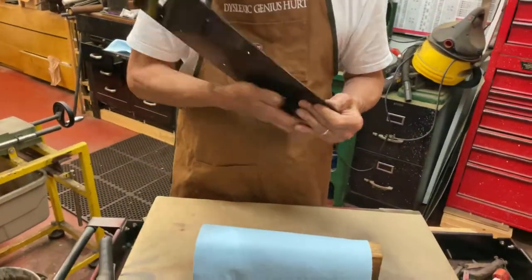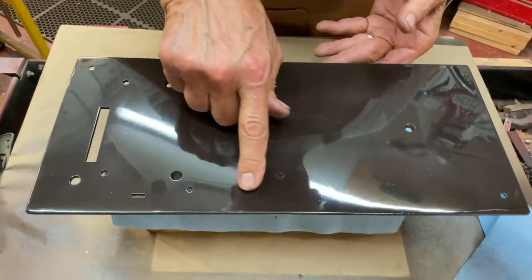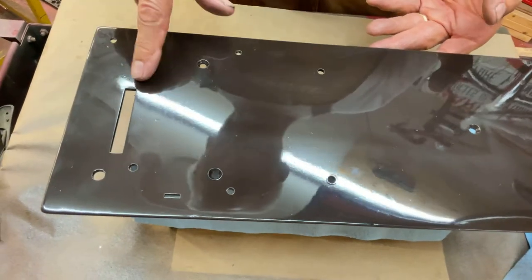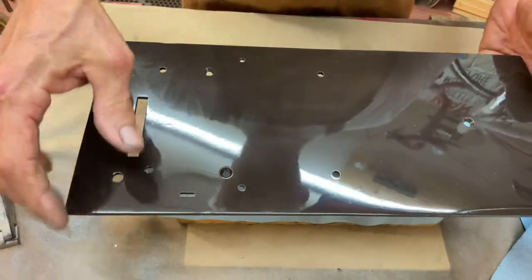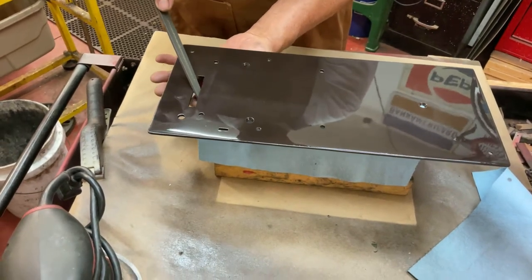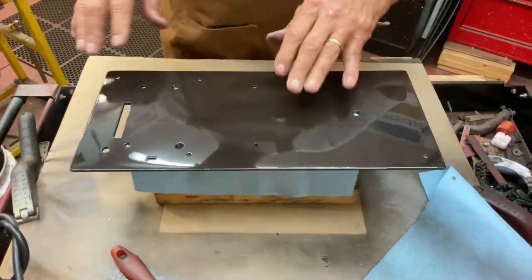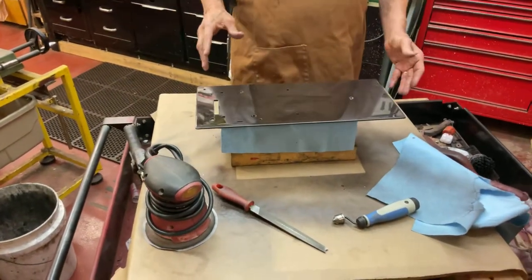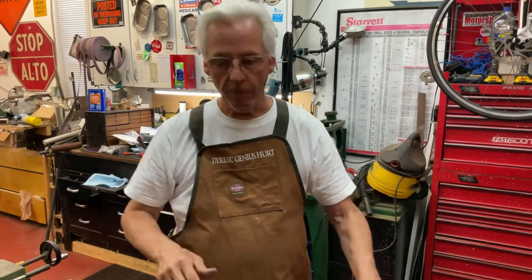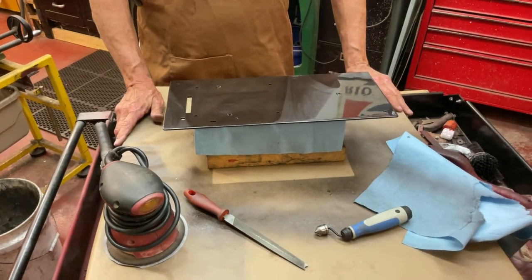So when you get to the top of it, now you're seeing the reflection from the paint. I've deburred all this, so these are all nice and smooth now. There are huge burrs here — I still have to get a little bit more. I got the burrs up here with a file and will gently come in and file that down — maybe with a jeweler's file or a really small file. Before I sprayed, I took my orbital sander with 320 grit, because this is like working on a big giant truck body and you want to smooth it out. It'll get a few of the rust lines out of the bed plate. I ran that over with 320, then polished it out and cleaned it before I gave the first shot of the black on it.